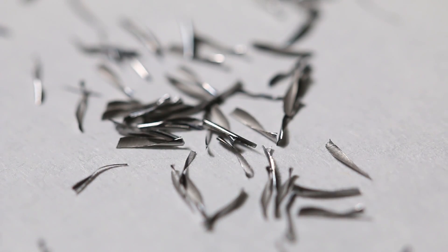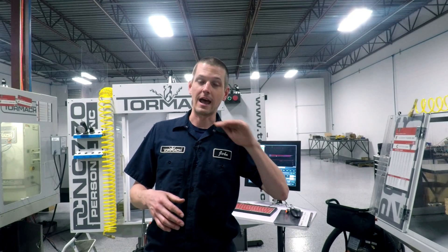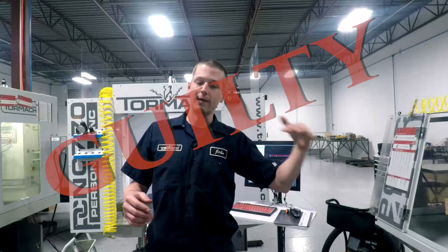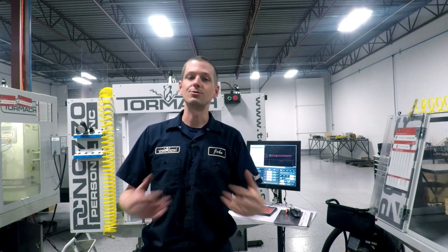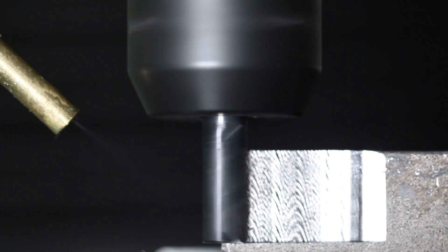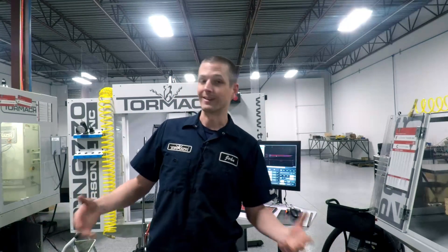That went great. Here's the thing — I am human. It's fun to talk on camera about baby steps, alternate this and that. I'll be honest: I'm actually guilty sometimes of not starting at the right starting point. I may or may not have filmed this whole video starting at a recommendation of 500 surface feet — way too fast, instant chatter. Don't do that. It's demoralizing, it's hard on your tools, and you've kind of just buggered up the whole result. I can't emphasize enough: start somewhere that is good. It gives you the confidence, you can read the chips — but I am human, so let's bump it up.